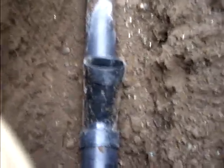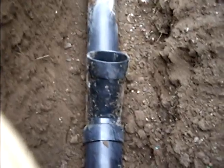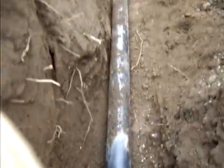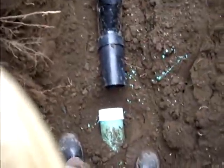That combo there is so that I can put a drain balloon in the pipe, because the city is going to want a pressure test on this line. I have to put an expanding balloon in my pipe and then fill the whole thing up with water to prove that all my joints are sound. So that's how we're going to make this connection.